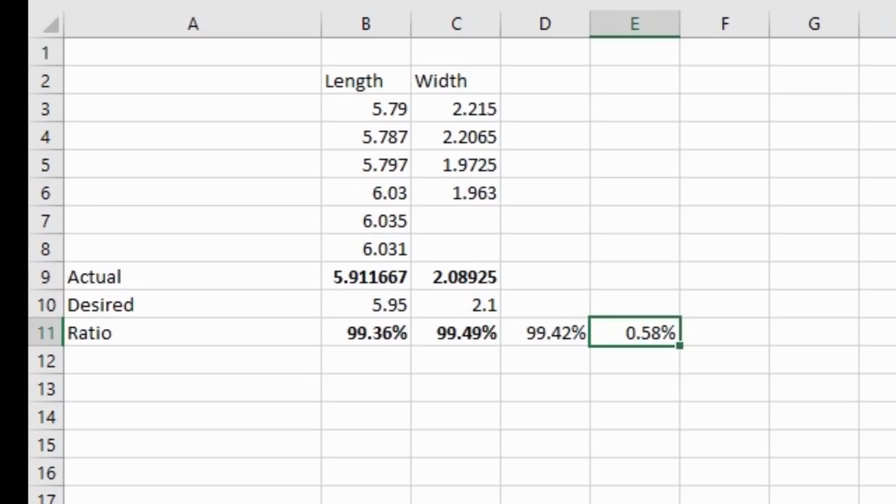And what we actually observed with our measurements, which, you know, granted were not super accurate, I took them with calipers, the part was flexible. The holes, of course, aren't entirely clean because there's little imperfections in the surface. The pins were different sizes. The holes probably weren't exactly round because of just goobers where the filament starts and stops. So this is in the ballpark, though. They call it 0.4%. I'm measuring 0.58%. I'm going to take a figure of probably 0.5% and say that's probably a reasonable amount to increase this by. So if I scale the part up by 0.5%, we should be very close to the correct size.